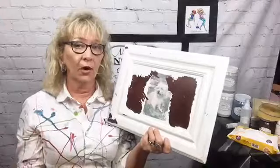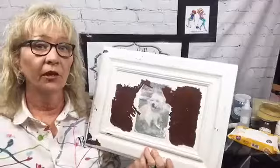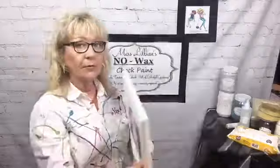If you have wax on your cabinets you're going to have to strip it using mineral spirits. That is one reason I never recommend using wax on cabinets. Whenever I was doing cabinets I would talk to my clients and say that eight to ten years down the road when you want to change, you're going to have to strip that off — and it's hard to find finishers that will take that extra step because it's a lot of work.